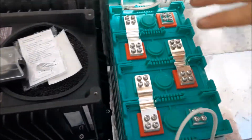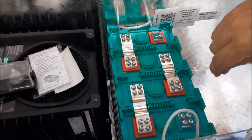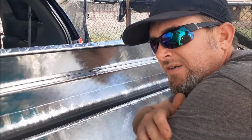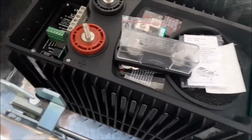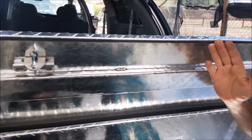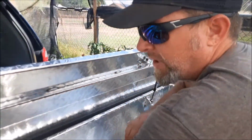So we're going to heat up these batteries in the event they're cold, and we're going to keep it from charging during that time so you can't damage the batteries in that process of warming them up if they're frozen and they need to charge. When they're frozen, they'll still deliver the same power out. The internal resistance changes with the cold, and it can damage them by trying to charge them. But if they're frozen, they won't even absorb. You can have power to it, and your voltage will go right up to the top. They won't suck the power up. So, pretty wild, but we're gonna get into it.